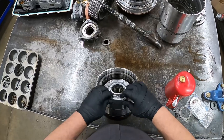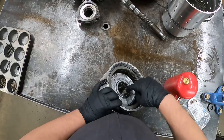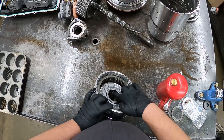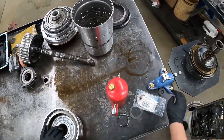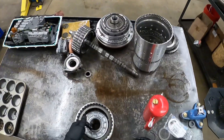These get replaced because you should not be able to see that hole. This sleeve in here just slid so far that way that it is causing pressure bleed off or some form of problem. Can't remember the exact problem or why it causes it to harsh shift, delay shift, all that good stuff.